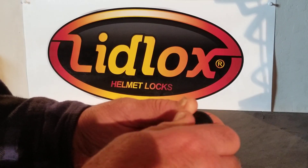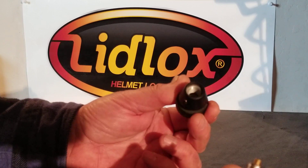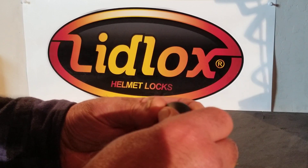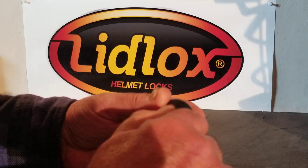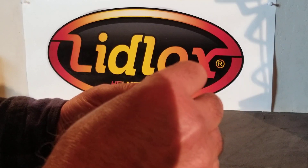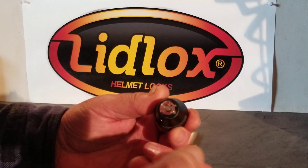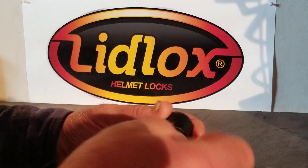There's no other way to grab it. Unscrew the old lock core, and when you get it far enough out you can grab it and unscrew it all the way. Then take your new lock core and thread it in as far as you can by hand.